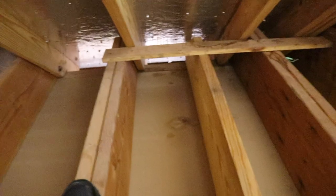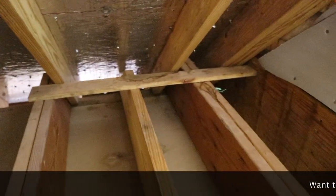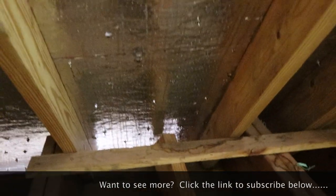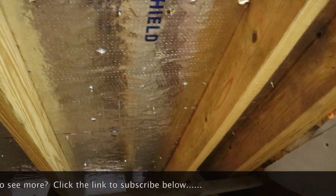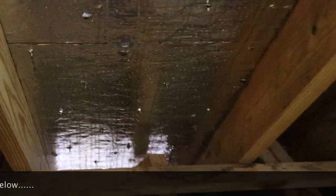Last spot is inside the attic area. It's a tight fit, but I'm going to show you where the shingles are leaking. You can see it's caused a small stain on the sheetrock, but only on the top side — no evidence of it below, and they weren't patching or painting. Right at the base, there are water stains, water stains over here in the corner, and then staining across the top of the radiant barrier.